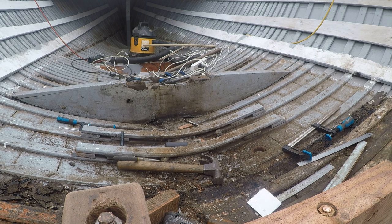These secondary ribs have been put in with silicon bronze nails and spacers, probably so that water can flow underneath them. I don't see that they do much to strengthen the boat, so I'm taking them out, removing the spacer blocks and reinstalling them, and roving and riveting on each one. So I think I'm putting 9 back in between the floors that I've put on the boat.